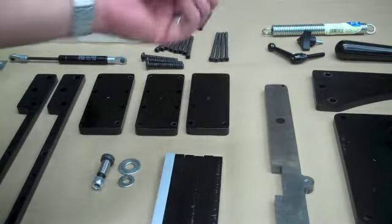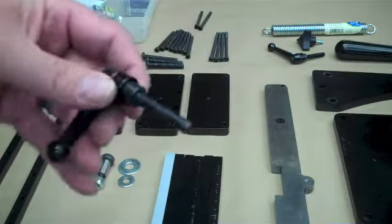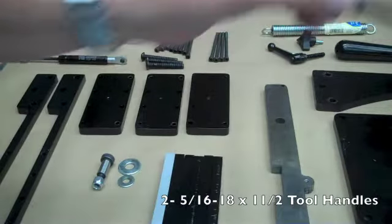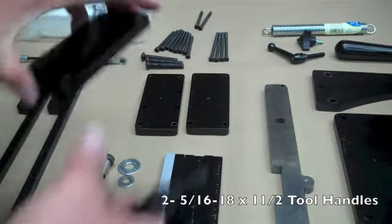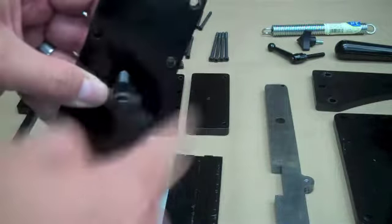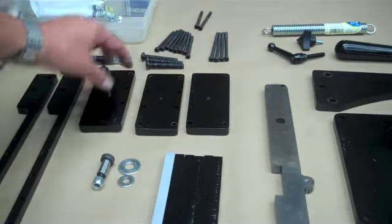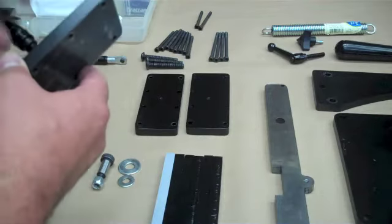The next thing we'll talk about is the tooling handles to lock down your arms. I found these — they are adjustable, so they will rotate and can be put in any position once you get your tool arm locked down. They are five-sixteenths by 18, and that's what we ended up threading our middle bolt hole with — a five-sixteenths 18 — and that's where these guys go. All of these have been threaded up. You don't need all three to be threaded, but I went ahead and did it just in case I decided to put one of these arms on the opposite side, so it gives me a little more freedom.